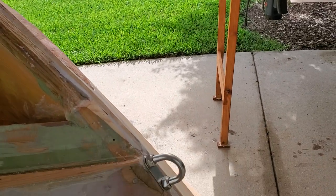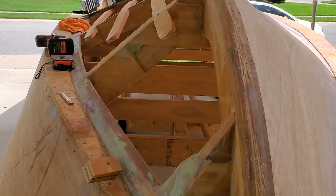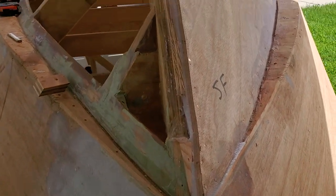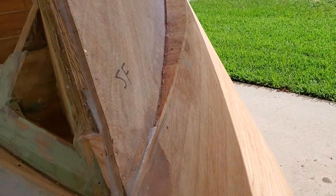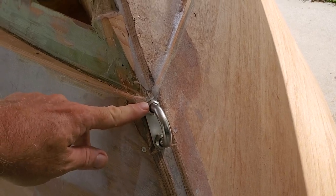With the other boat — the Jeff Spira V-Dory, the blue V-Dory y'all probably saw — I just lucked out. It just barely makes the roller when I'm cranking it in to put it back on the trailer; it fits, but just barely. I wanted to make sure that was not going to be the case here. I took my measurement from the boat and trailer I have now, and a rough estimate was basically 24 inches between the bottom of the boat and the first bolt hole. I believe 24 inches on this one ends up being right there, so this is going to be a little bit shorter.